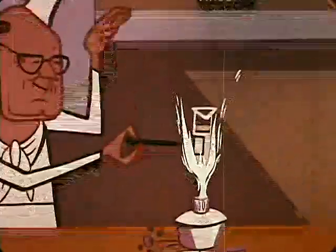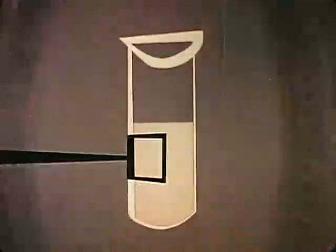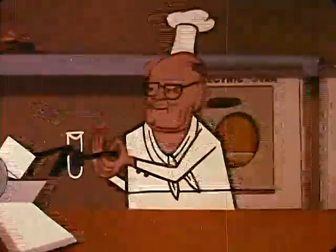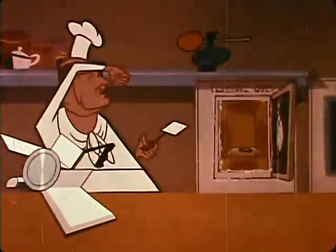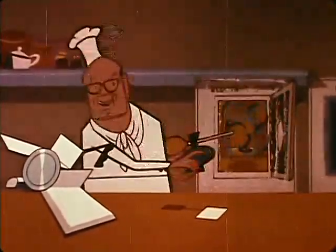So we purify it and purify it until it's as pure as the driven snow. Now melt the silicon and add just a pinch of arsenic for flavor. Mix thoroughly and cool until it crystallizes. Then, from the arsenic-flavored silicon roll, slice off a razor-thin wafer. Put the wafer into the oven, fill the oven with boron gas, and bake to white heat. The boron cooks into the surface and forms an extremely thin icing over the wafer.